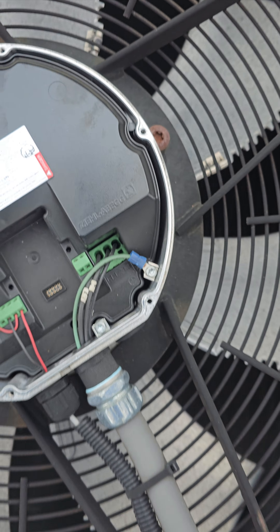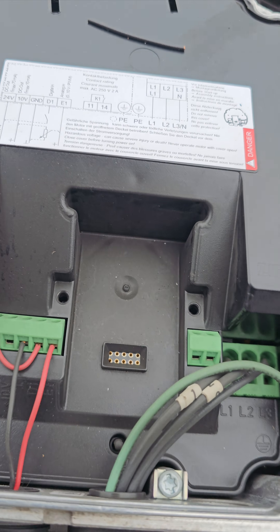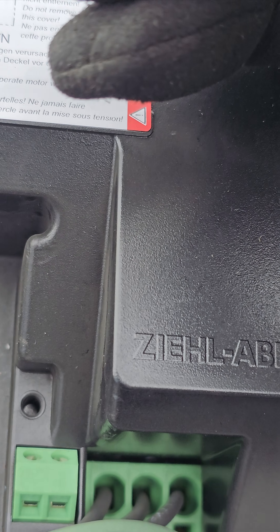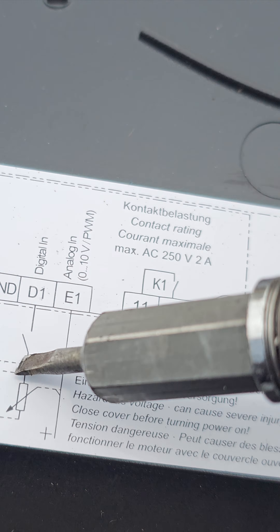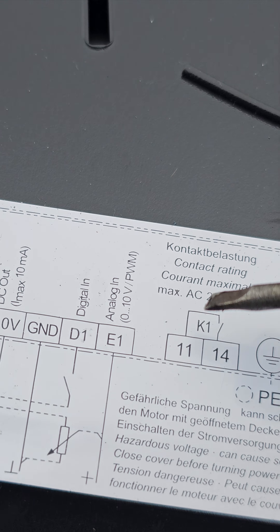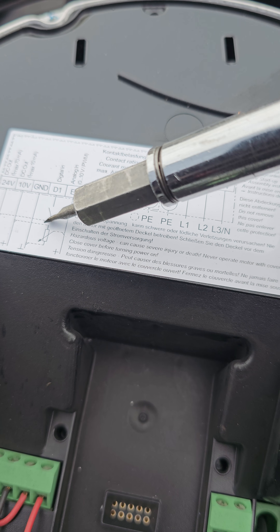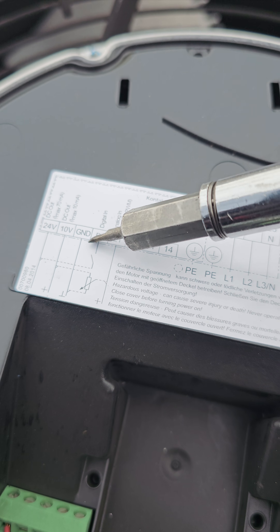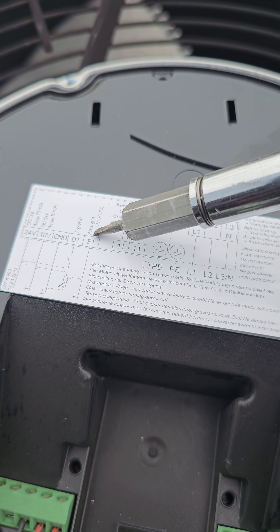Okay, here we've got one that's not cooked. The minimum you need to make this motor run is an enable on DI1 — digital input one — and you can program this for normally open or normally closed contact switches. Right now it's set up for normally open, so whenever you close it and send a signal into digital input one, the motor will be ready to run. But it won't run yet — then you also need a reference signal on E1, which is zero-to-10-volt analog input.